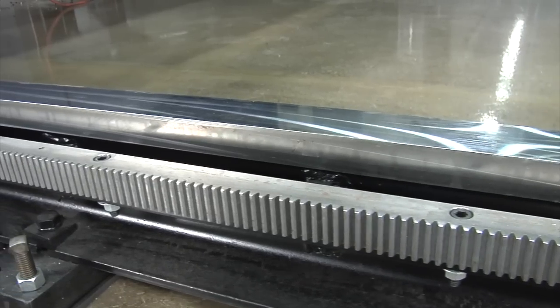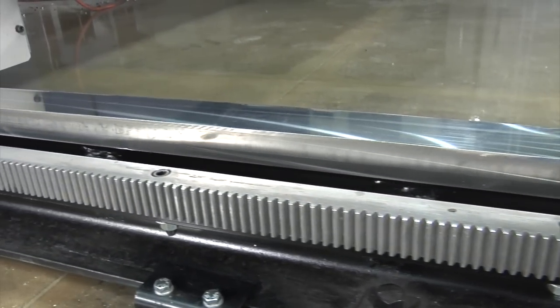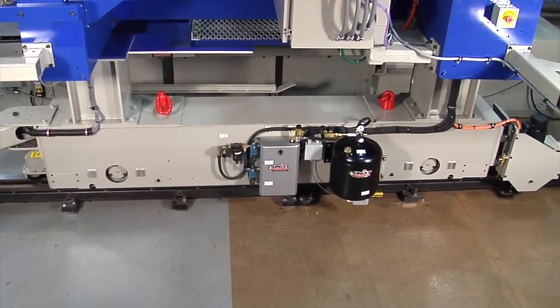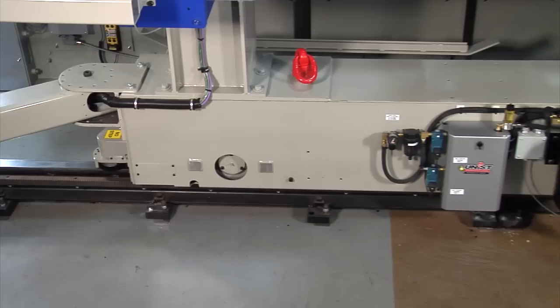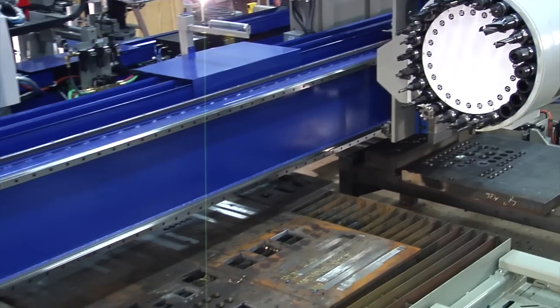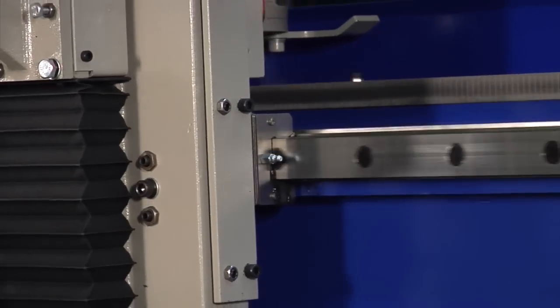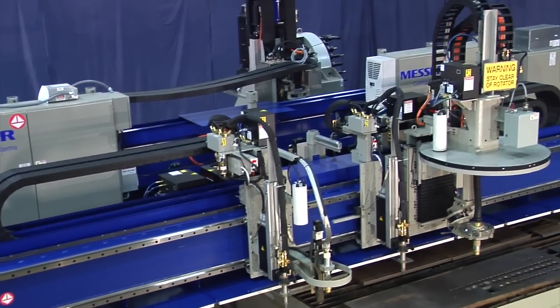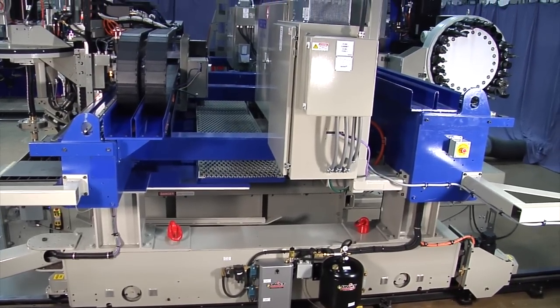The machine is supported with 115-pound machined longitudinal crane rail coupled with large diameter wheels to help reduce inertia and provide easy movement. Large welded end trucks provide stability, and a pair of heavy-walled machined beams with linear ways ensures solid support of the carriages. Rugged and proven construction for your shop's work environment.